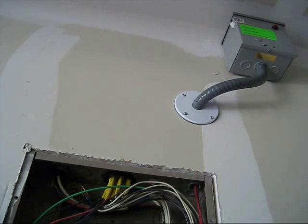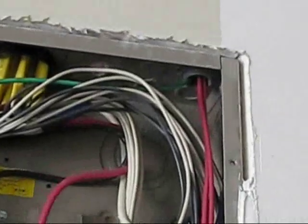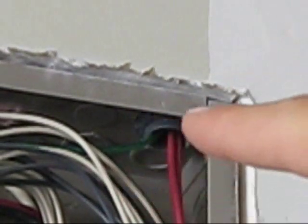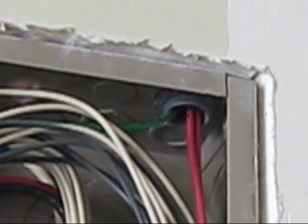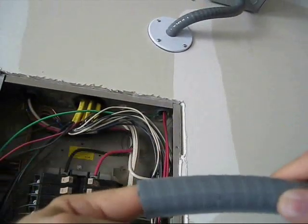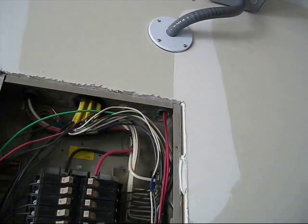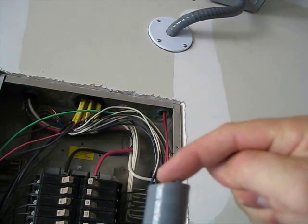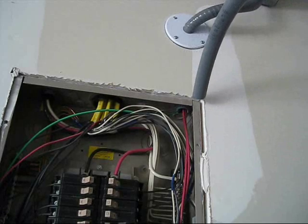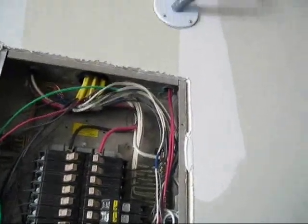What I did was I put this adapter, this little three quarter inch — you can get it at Home Depot. Just show them the three quarter inch gray conduit protector cable, whatever that stuff is, and tell them you need the little piece of hardware that goes on it. What I did first was take that piece of hardware and push it into the end of this. I made a big hole back there in the drywall behind that nice looking plate — it had to be big so that whole piece of hardware could sit on top. I wanted to be able to feed that whole thing through so I could throw this little screw on there, the little seat that holds it into the box, and then once it was in, I just tightened up my plate.